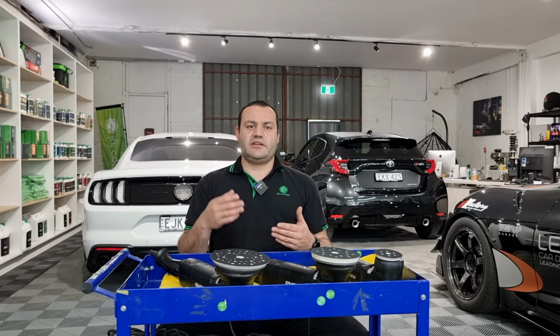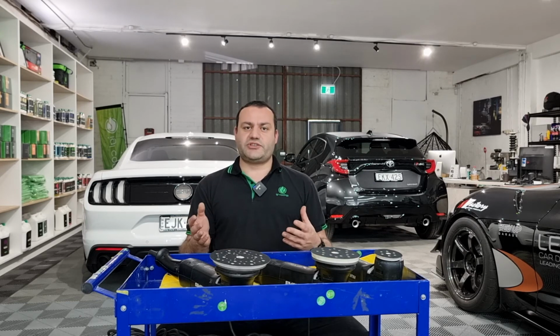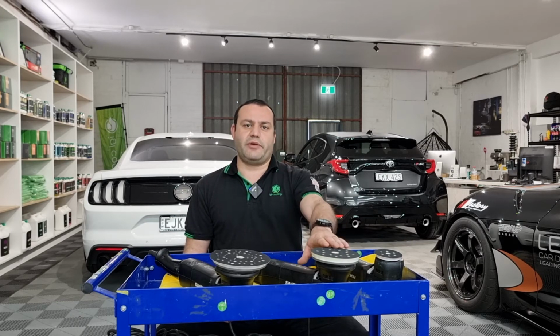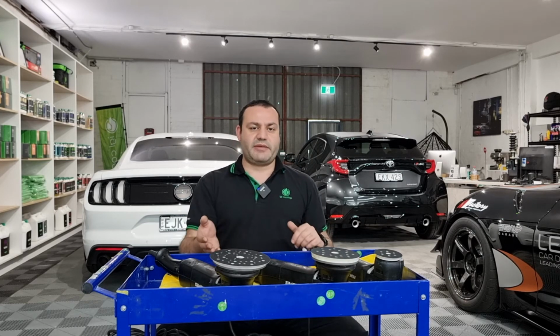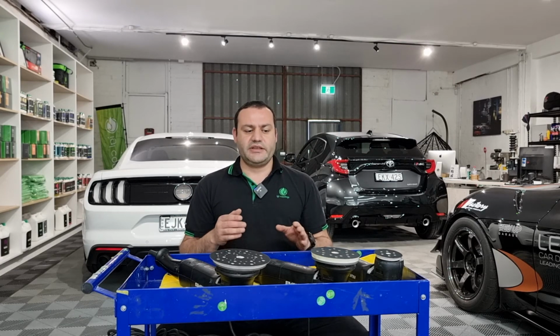So you have a smaller counterweight because the backing plate is smaller. The machine has less throw. The vibrations are less, and probably leads to this machine just having a little bit slower rate of wear and tear compared to these. But they're both very, very reliable machines. And as I mentioned, I just had all three of them come back from repairs after getting serviced. So they're all very much serviceable.